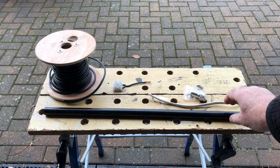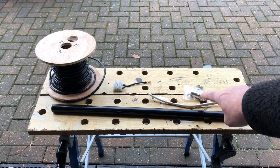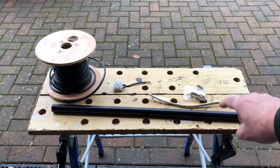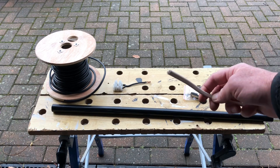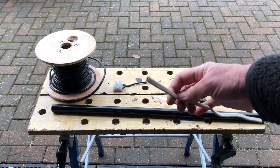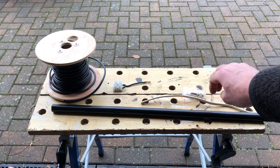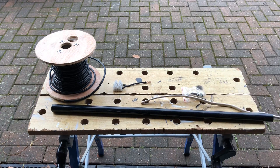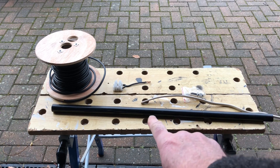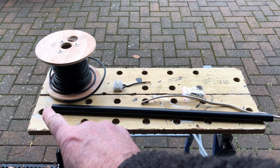Another piece of 20mm conduit — this is my last piece so hopefully this goes well — a PL-259, some RG-58. I don't have any 1mm enameled copper wire so I'm using this domestic mains cable; the core is 1mm anyway. I need a 3.5mm former — I don't have a 3.5mm drill but that black wire is 3.5mm in diameter. So basically: PL-259 on one end, some RG-58 through the plastic, and a 3.5mm three-turn coil on the bottom.